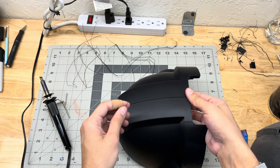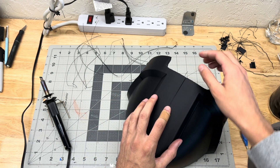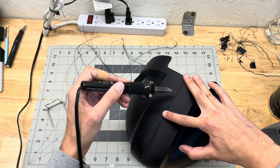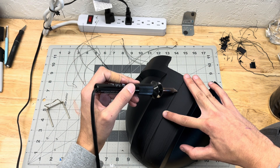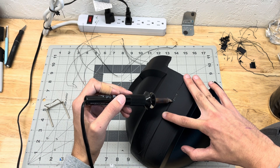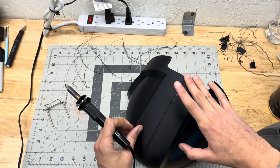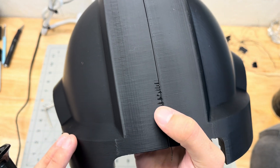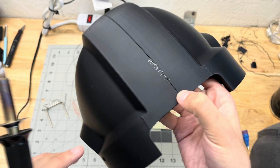What you're going to do is push that filament down into your seam just like this, and with your wood burner or soldering iron — whatever you have — just very lightly tap it to get some points melted in there. Try not to pull it like I just did because that's going to free it from the seam. That gives me something to show — I just hit it a few times over certain spots and it's holding that piece of brim in the seam.